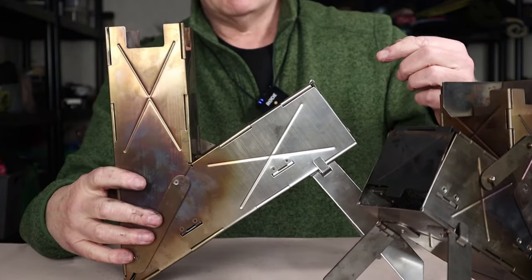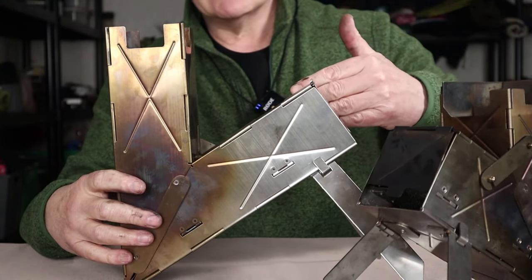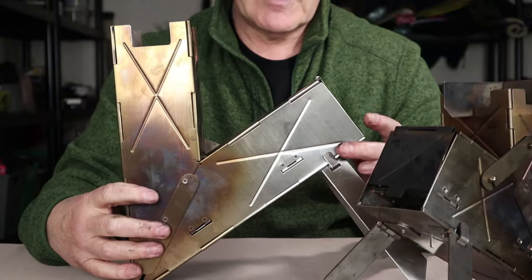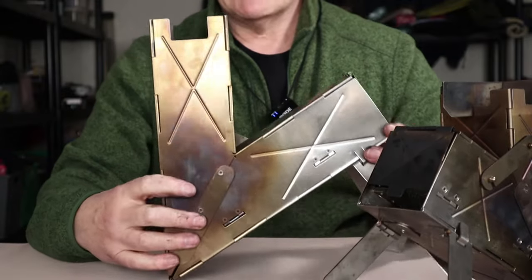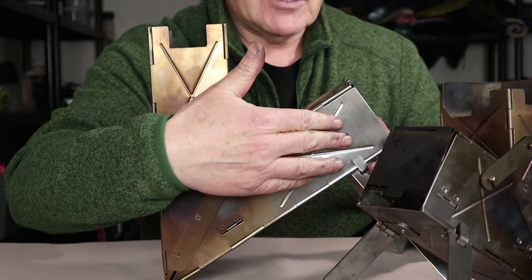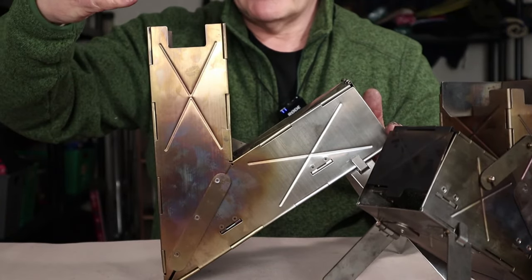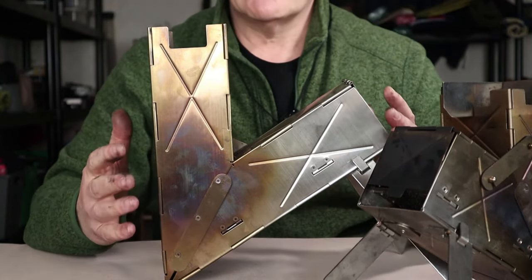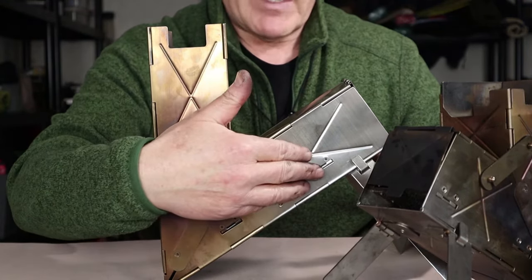Another part of the design is a feed ramp, most of the time at a bit of an angle. That angle provides two things: the ability for wood to self-feed inwards as it slides down as the wood at the bottom is consumed, and with the ramp allowing air to flow in underneath the wood, combustion is limited to right at the fire grate. It doesn't run back up the feed ramp because the air preferentially flows in and up. You should not have smoke backing out of the feed ramp — if you do, the ratio isn't correct and it won't burn as efficiently.